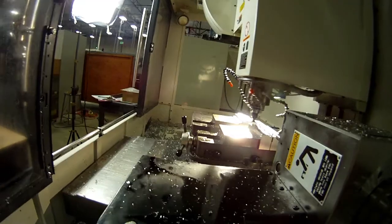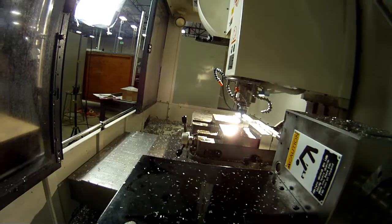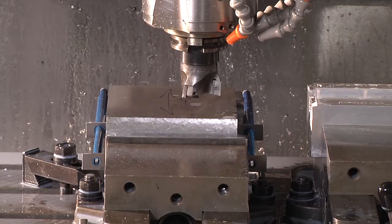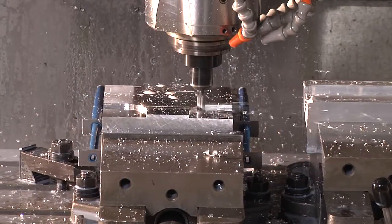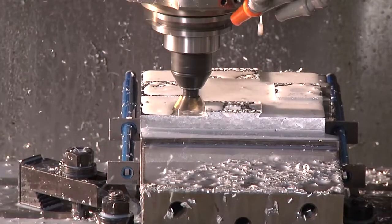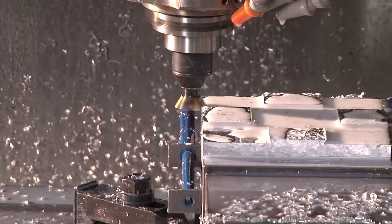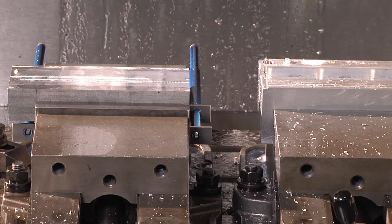In this particular case, and in most aluminum applications, we use 3 tools to prep. It is a very simple process. We use a 2-inch high shear. This is called a shoulder cutting face mill. We will use a 3/8 carbide end mill, 3 or 4 flute. Also, we use a 60-degree, .750 diameter inserted dovetail tool. The process is very quick. I'll talk through the machining process as it runs.